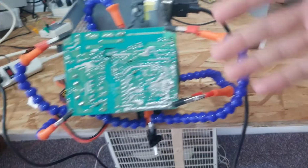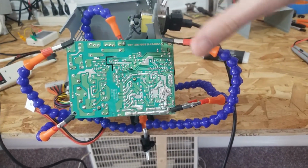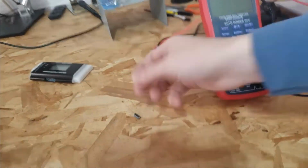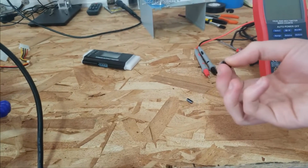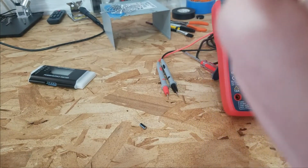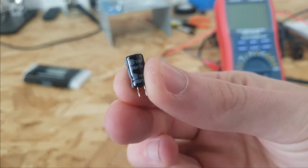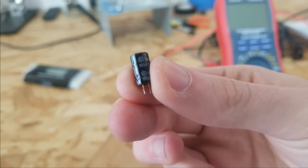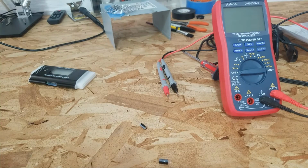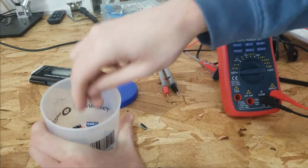So I'm over here recapping this power supply that's 20 years old, literally from the year 2000. I'm finding a bunch of these Teapo caps that I've had bad experience with. They're all bulged and leaky. These types, I don't know how you pronounce that, Fuhjyyu or something, the really crappy type. I have some more in my bad cap bin.